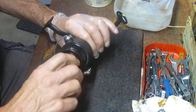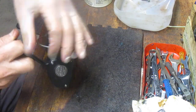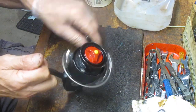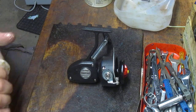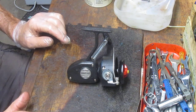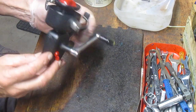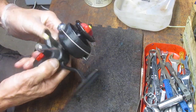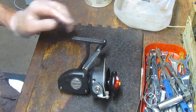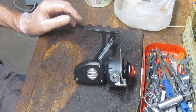We've just done the drag service — no oil is required on Teflon drags. Just buttoning this up, and I'm sure I'm going to hear that noise again. Yeah, we still have that grind going on, but that doesn't mean that the reel can't reel, and that a kid couldn't enjoy this. That's probably where this reel is destined — I'll find somebody who wants to do some freshwater or bay fishing and put a smile on somebody's face. Now that it's all lubed up and ready to go, I encourage you to find flea market reels, take them apart, see how they're made. Limited investment, limited risk, and a lifetime of experience gained. I hope you've enjoyed the video — if you did, please like it, and if you want to see more, please subscribe to my channel. Again, this is Dennis with Second Chance Tackle — thank you for watching.